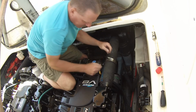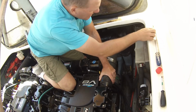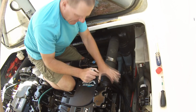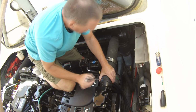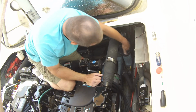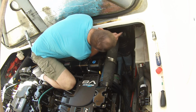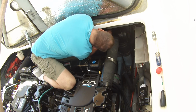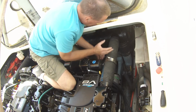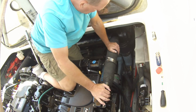That indicates to me to get this off of here, because there's an inner pipe in this thing, which I'm guessing this is the outer water jacket, and then the inner, actually the exhaust pipe. So what I'm going to have to do is take this crossover off by raising that, disconnecting the bypass, which is back there with its own little muffler. Okay, so I'm going to take that off, and then lift that to get out of the way, to pull this pipe right off without removing the riser.